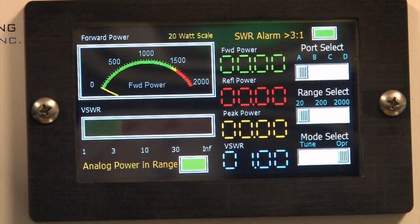Now let's look at sending CW and seeing peak output power. The keyer is set to run about 40 words a minute. Sending a single dit, you can see the average power was zero but the peak power was 55 watts. Running it continuously, we're seeing 55 to 56 watts — demonstrating that the DWM2 can measure instantaneous peak power.